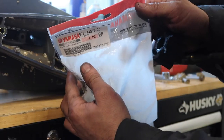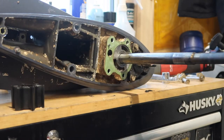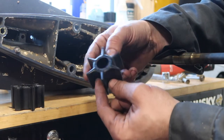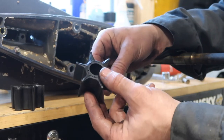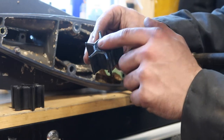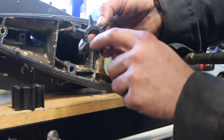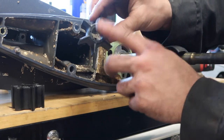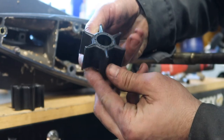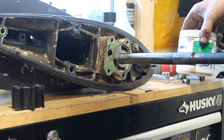All right, we're ready for our new impeller — there's your part number right there. I recommend going with a Yamaha one; they're built a lot better than the aftermarket ones. At my work we're an aftermarket dealer for Sierra parts, but I get them for about half the price at Sierra and I still go with the Yamaha ones because they're built that much better. They've got all these little ribs on here. Anyways, you've got your keyway which is right here, and on the other side there'll be a slot, so you can only put it on one way. On genuine Yamaha ones the keyway is here and not on this side, so it has to go down that way. Take some marine grease and put it on the shaft so it slides easier.